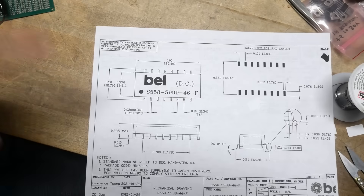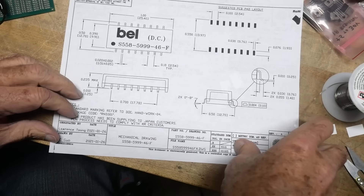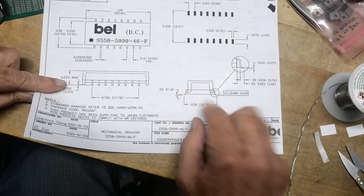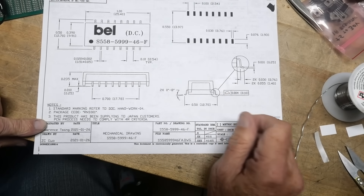It's a little bit strange, a little bit different. It looks like a gullwing SMD package. These are the gullwings — they come down and they come back. The PC board sits here, and you get a little fill of solder under there. Very nice.